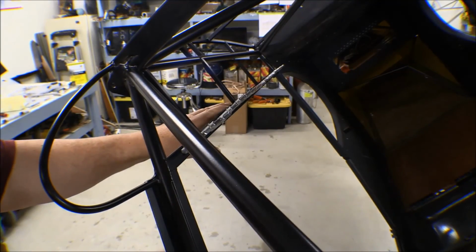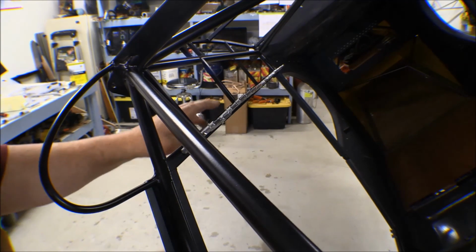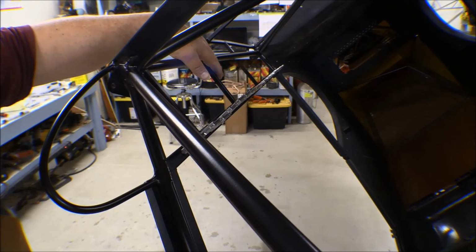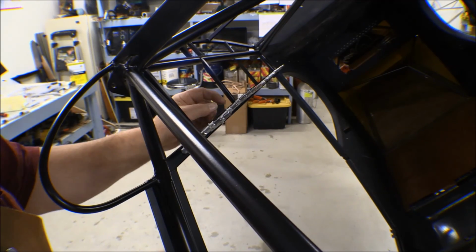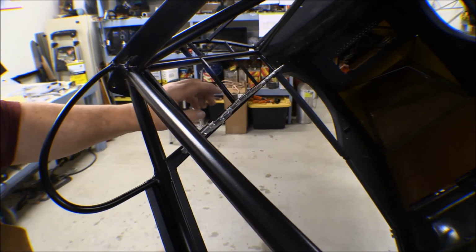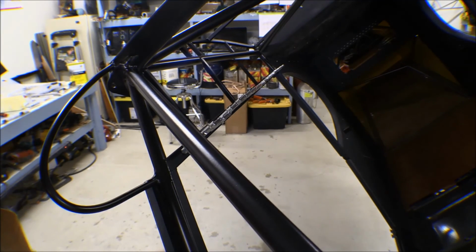Got this header for the door frame all drilled out and set up with nut plates to use to hold the bottom of that wing root cover on, and it's also going to have a door seal underneath that, so I need quite a bit of support for that to keep it from flaring out. So I've got it set up with number 4 Tinnerman nuts. They're all drilled and set in there, clecoed, ready to go.